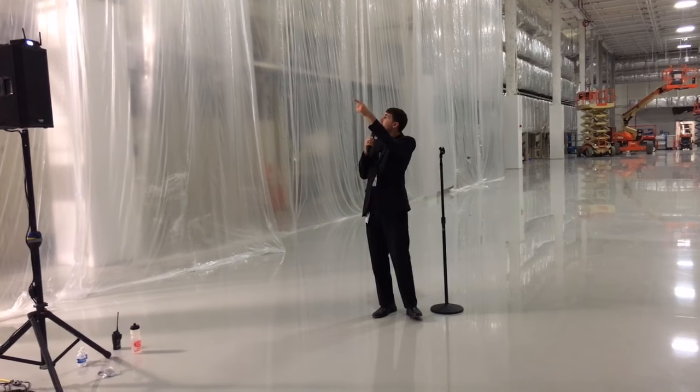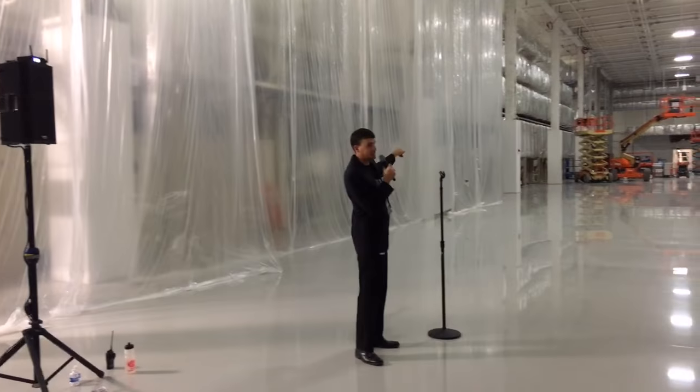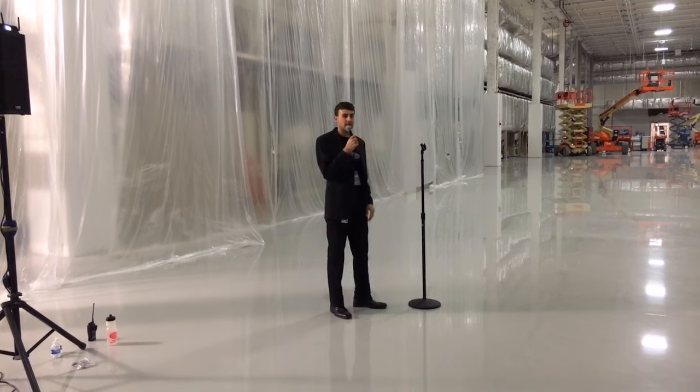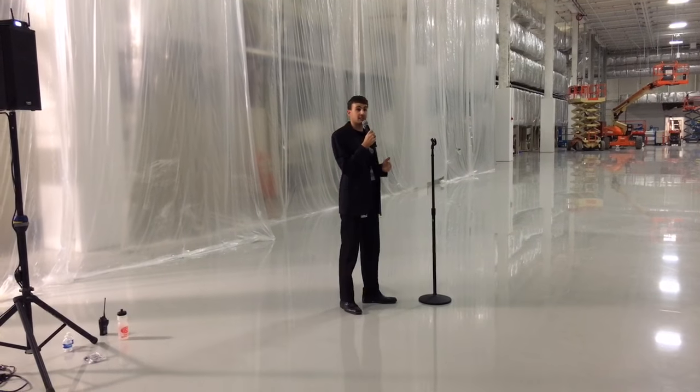We then turn up and go across. Essentially, the bottom of the foil becomes the top, and we coat the other side. Send it all the way back down the other side, where we have a fully coated foil with two active battery layers on either side of it.